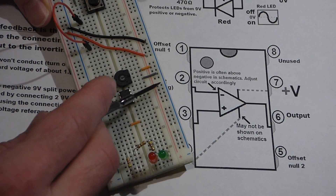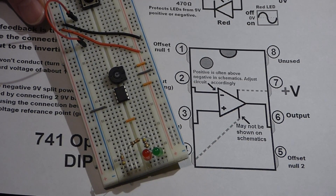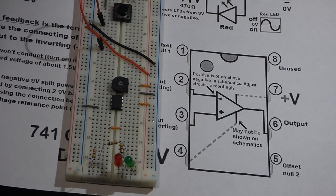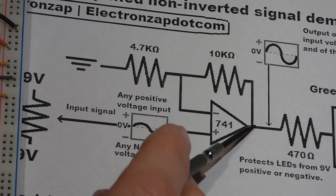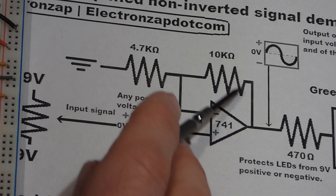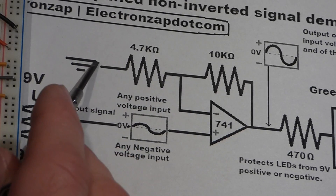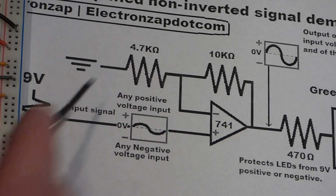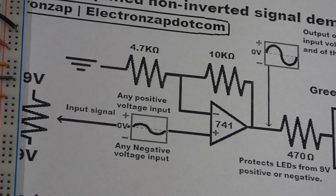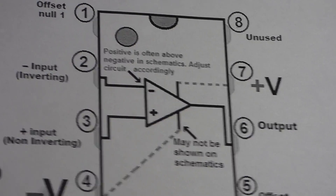From one end to the other we have an 18-volt difference, but that's just for the chip to give us either about positive nine volts or about negative nine volts — it's slightly lower. To control the amount of amplification, we take the output and connect it to the inverting pin with a negative feedback resistor. That resistor also has another resistor connected to ground, and the values of these two resistors determine the amount of amplification.